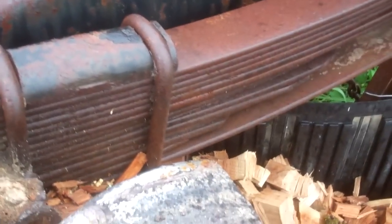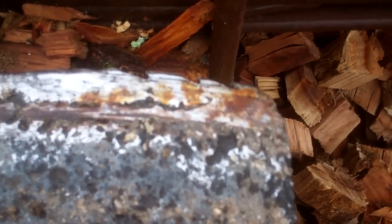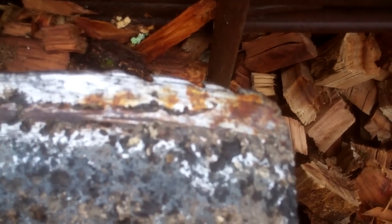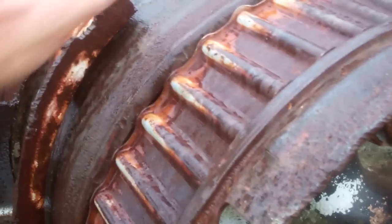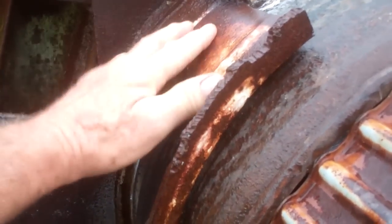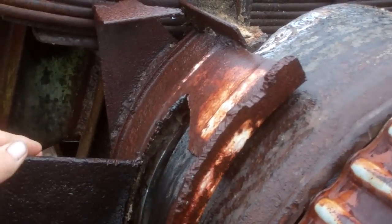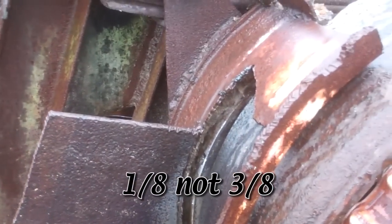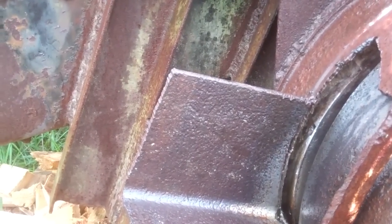Also, if there's any strings or fibers attaching the blocks, I've got some little hooks ground in right there that will catch the strings and make sure that it separates all the pieces. The thickness of these rims is about 3/16ths, and this one here is also a rim at about 3/16ths metal. This piece is 3/8ths, but you've got to make sure you've got some heavy stuff down below securing all of this.